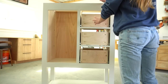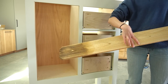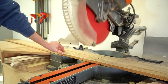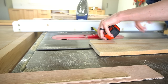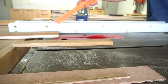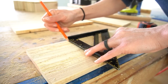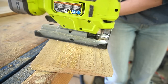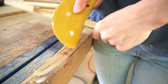I wanted the door and drawers to have a heavy texture to give it more of a rustic feel, so I decided to use cedar fence pickets for the drawer fronts. This is like a one by six — five and a half inches wide — obviously the opening is bigger than that, so I'm just going to piece the drawer fronts together. These cedar fence pickets are really pretty after they've been sanded, so I thought they'd be perfect here. I cut to fit pieces of fence pickets for all three drawer fronts. There's usually quite a bit of variation in these boards, so I advise cutting to fit since they're not all the same width. Once I made sure everything fit, I used a jigsaw to cut out a section across the top of each drawer front. This will allow me to open the drawers without using any hardware like a knob or a pull, since the sliding door will likely interfere with any kind of hardware.